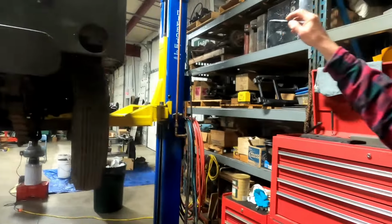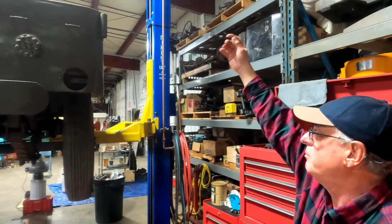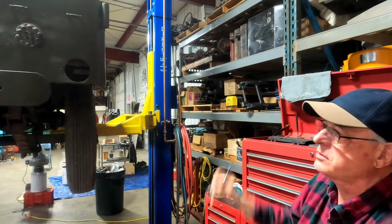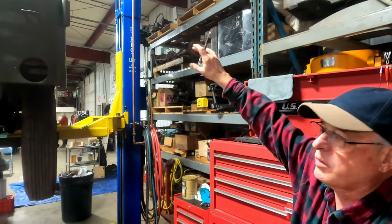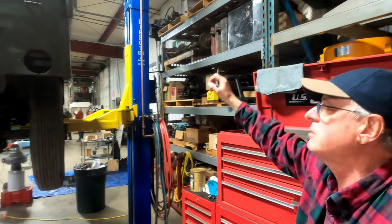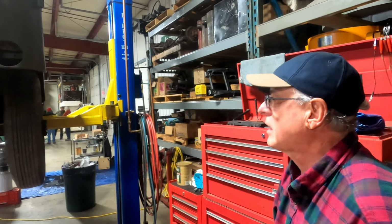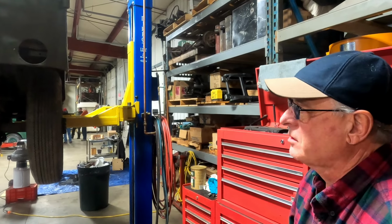Series 1 has two hood blocks that hold the hood, and the hood bumps up against the windshield. That's a dead giveaway, whether they're Series 1 or Series 2. The seats have ribs in the back of them in a Series 2. There are some changes throughout. I can't remember all the little changes, but